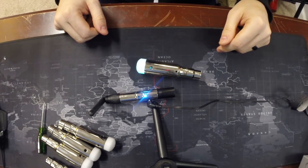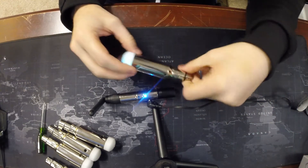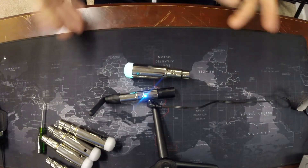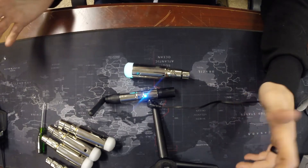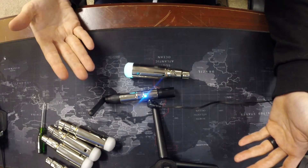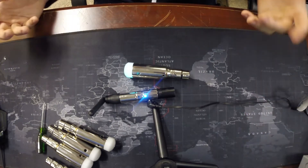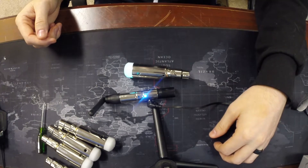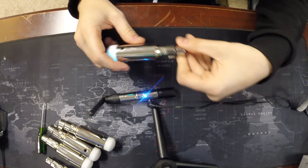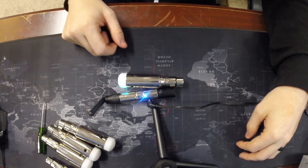That's the Donner wireless DMX system — pretty simple. One transmitter, a bunch of battery-powered receivers. The range is great; I've never had an issue with it. Typically I'm in a ballroom and fixtures are close to the transmitter. They claim around 300 meters or 1,000 feet, which I've never tested, but I don't see why they wouldn't reach that. These are 2.4 GHz, so performance could be slightly reduced if there are many Wi-Fi networks around, but I've never had a syncing or range issue.